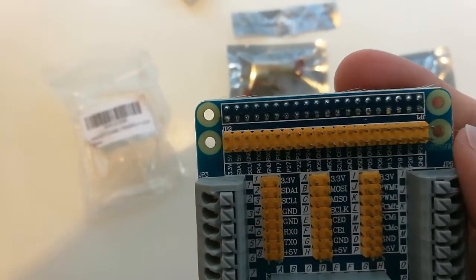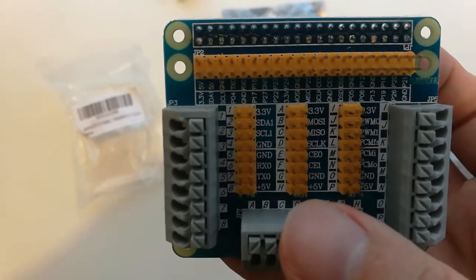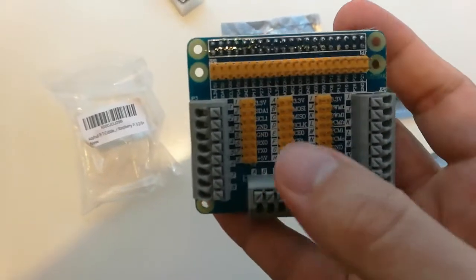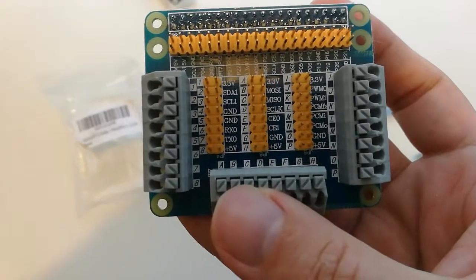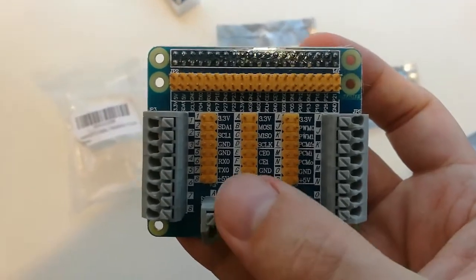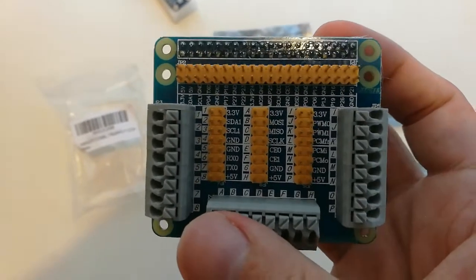The GPIO looks like a straight pass-through, so you could actually stack this with another board. Then here you have A, B, C, D, E, F, G. I wonder if you put the jumpers on to say what these pins are doing. It may be that you can reconfigure what these outer pins are connected to, and maybe jumper wire them across if you wanted to reconfigure them. This could be a very interesting way to get to various pins on the Pi and break them out.